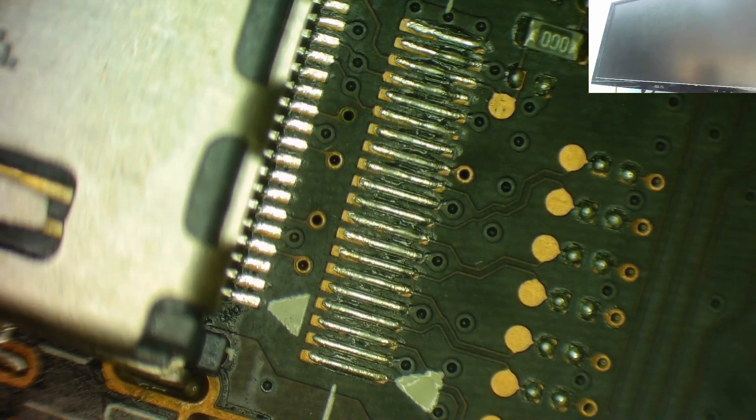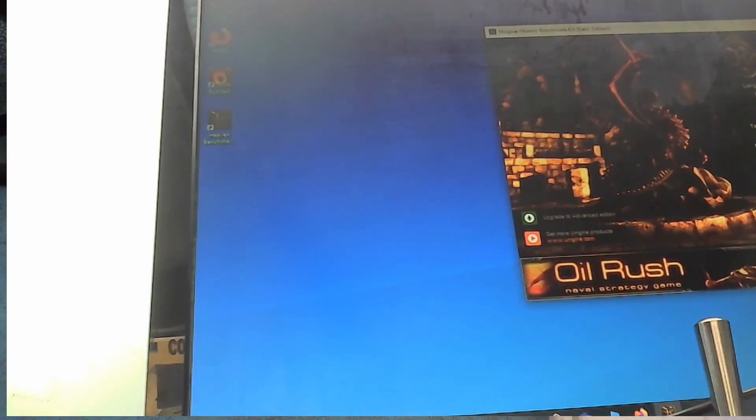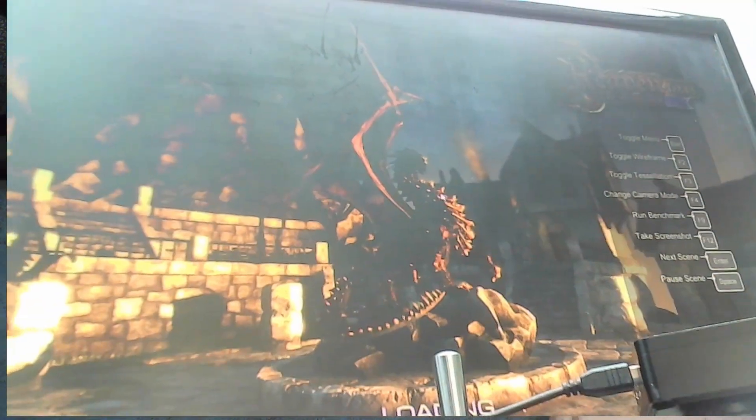That's definitely nice and clean now. I'll put it back together and give it another go with the HDMI cable to see if that made any difference. Strangely enough, now on the HDMI connector I went straight into Windows with icons! Let's see if it works again - running Heaven benchmark. So far so good. I have to say - I don't believe it. It's remarkable that cleaning that connector would have been the cause of the problem. It's running!